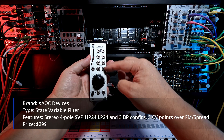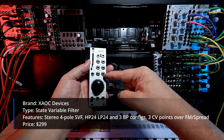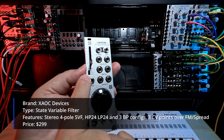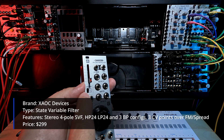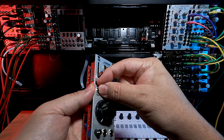Three of them are available all at once. There's a high-pass 24, there's a low-pass 24, and then there's a bandpass in the middle with three different settings. There's a high 18 / low 6, a high 12 / low 12, and a high 6 / low 18 — selectable on this little toggle switch right here.